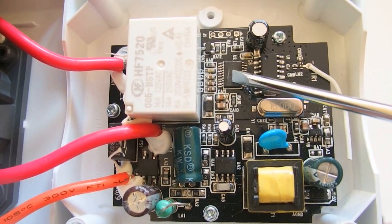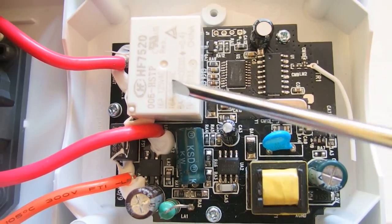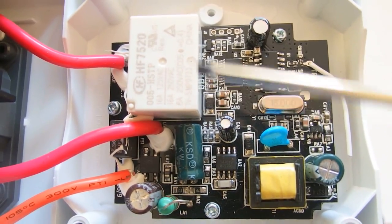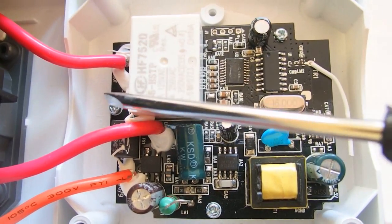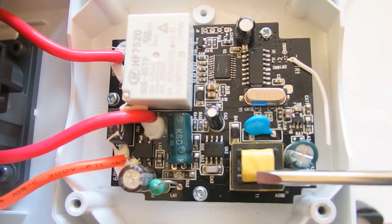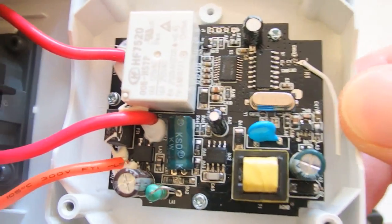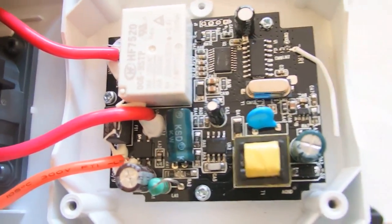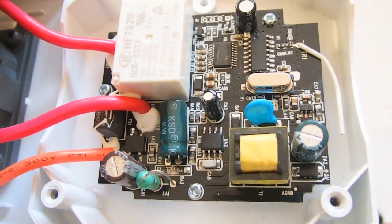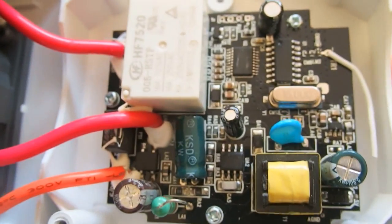There's an antenna. There's another chip — it's probably a microcontroller — and a lot of passives, a transistor, and there's the power relay: 250 volts, 16 amps, and the coil is probably 5 volts. This is switching the power, but only one pole is being switched — single pole switching. I was expecting just a capacitive dropper to power this up, but there's actually a switching power supply. This doesn't even have to be isolated from mains since it's completely enclosed and not accessible from the outside, but they chose a proper power supply anyway. There's an interference capacitor rated 1 nanofarad at 2 kV — actually rated higher than the capacitors in USB chargers where you can touch the output. So that's generous.